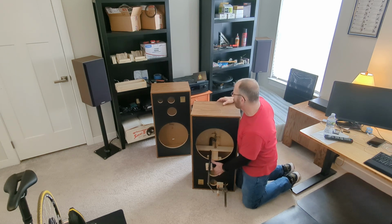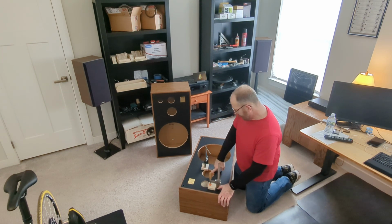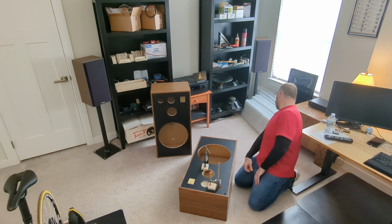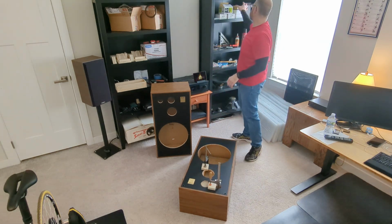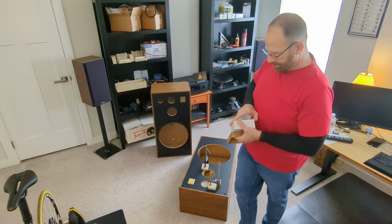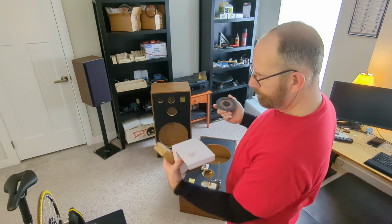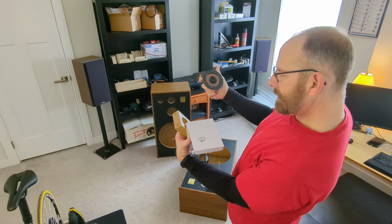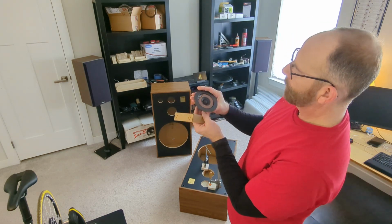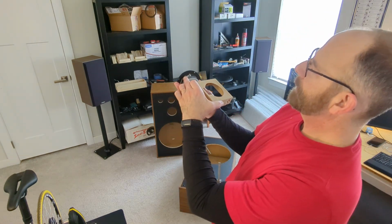The other thing that I did along the way is these holes here, the tweeter hole and the mid-range hole. I really did need to notch those out a little bit. So like this is the tweeter that's going to go in here, and this was a Parts Express GRS, and it's a phenolic ring tweeter. I guess this is a revamped version of the old Marantz phenolic dome tweeter. Anyway, I'm hoping this gives me a really nice smooth sound, but you'll see where the terminals are here.